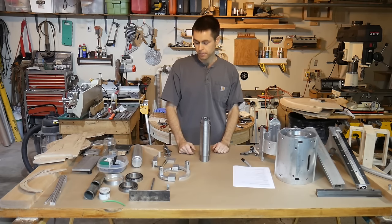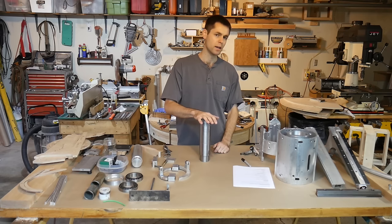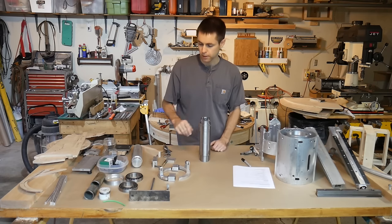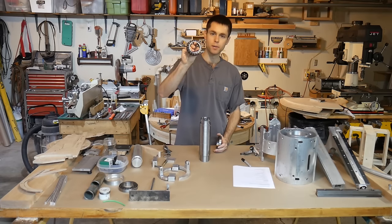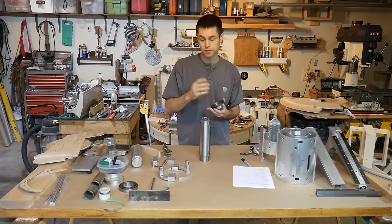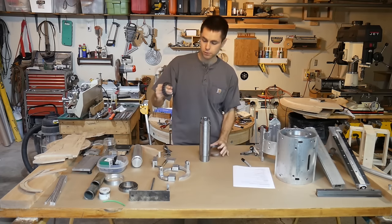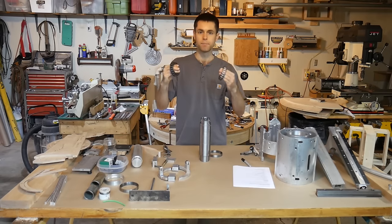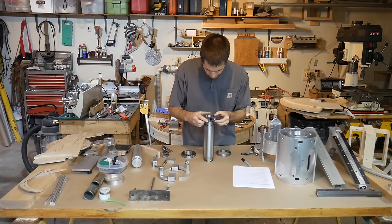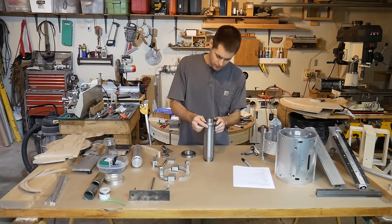You can buy bearings that have very low play and all sorts of other things, and they're very expensive. Because I didn't want to have any more play than I absolutely had to, what I settled on were taper bearings, like so. These are wheel bearings, originally designed for an F-350 pickup truck. The thing with taper bearings is that if you have two of them and you compress them, that takes out any play. They have a tendency to jam up, so you have to be rather careful. If you put them on right, they go on very easily, but it can be deceiving.